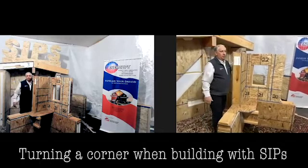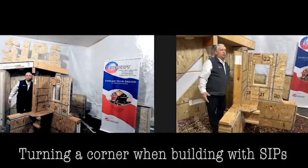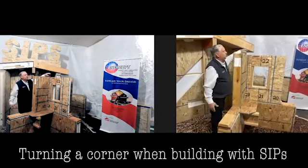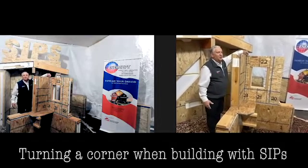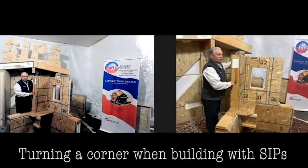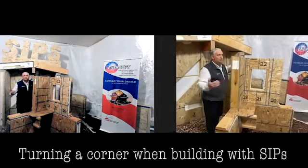Typically speaking, when I come to a house to start building, I'll start in a corner and use just drywall screws to tack together one corner. That panel on this side is the last panel I'm going to install on the wall, but I use it to brace the corner. Then you can continue on and you don't have to worry about bracing as you go.